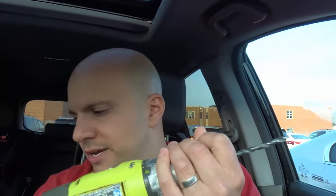You can put the drill in reverse, hold your hand on the chuck, and then just lightly push on the lever. Don't push hard — lightly push, and hopefully you get it to loosen up just like that. Obviously mine wasn't really stuck that tightly.